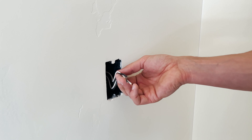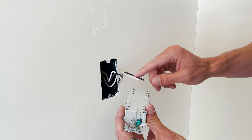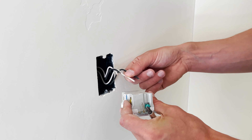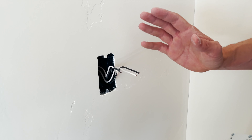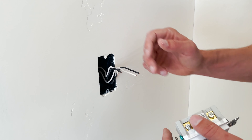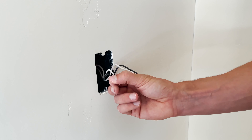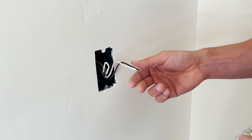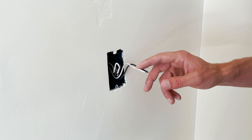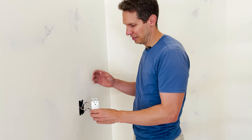If you're just replacing an old GFCI — because they do go bad — make sure you note which wire was on line and which was on load before you pull it off, so you can reconnect them to the right spots. If you're doing new construction, have everything well marked before you enclose the wall. My memory is bad enough that I think you should just mark everything so you know exactly which wire is coming in and which is going out. You don't need to do that with most outlets, but with GFCI outlets you do.